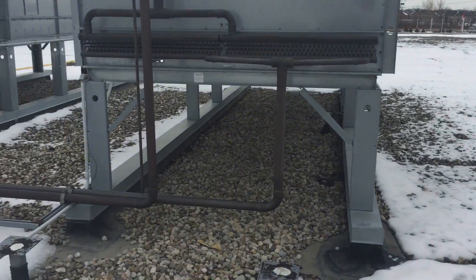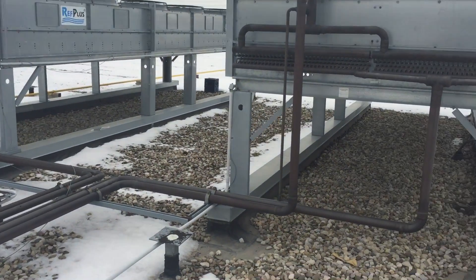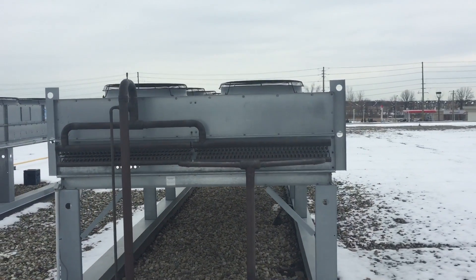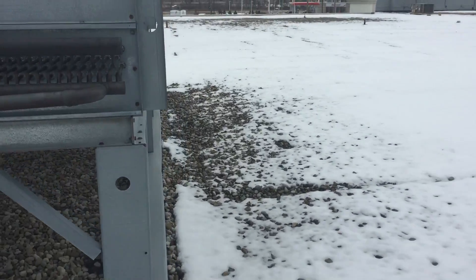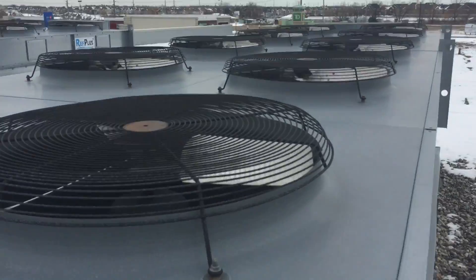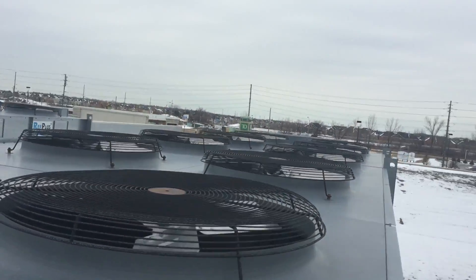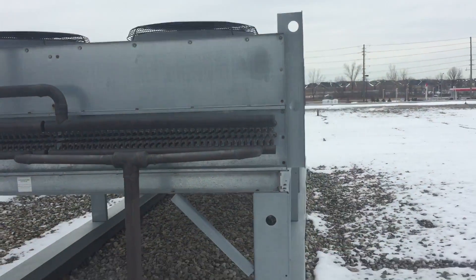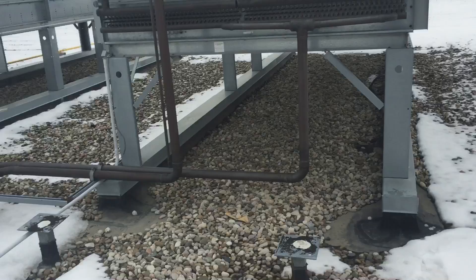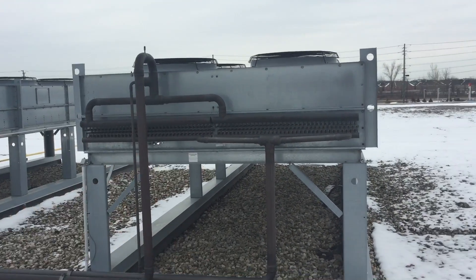One thing I want to show you, because I think it'll be useful: if you're working on a big refrigeration system, the condensers are great but they can also be a pain. We've got fans here — I'll just show you. So we've got ten fans. Usually they work in pairs, so your front two would be your primary and then the others would follow as needed.